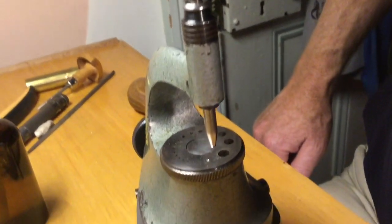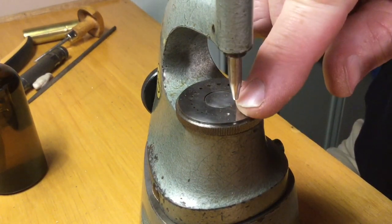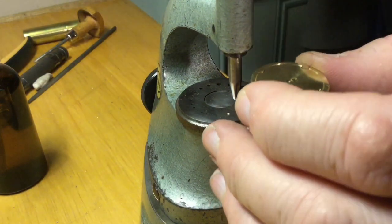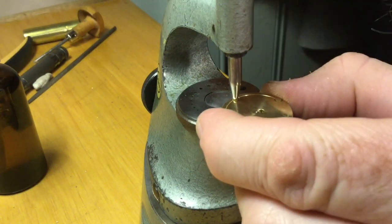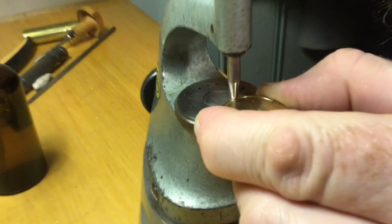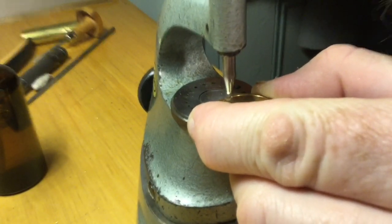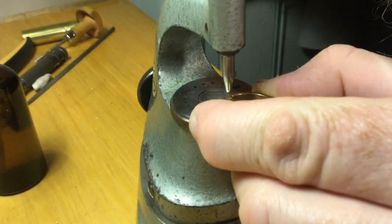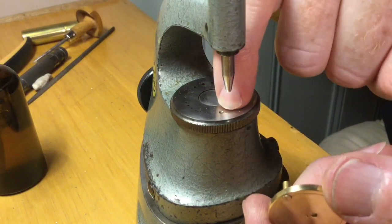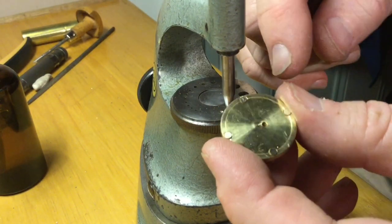With my staking set, a light hammer, and a slightly domed punch, I work over the entire surface of the cut end of each leg, riveting it over. You could make a suitable punch out of music wire and stand the pallet table on a block of steel — maybe with some Blu-Tack in the middle to stop it moving. I'm making sure the bottom of the leg is on solid metal so the leg can't get pushed down during hammering and become loose.